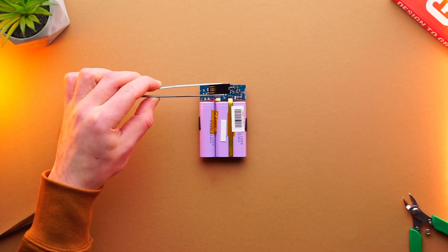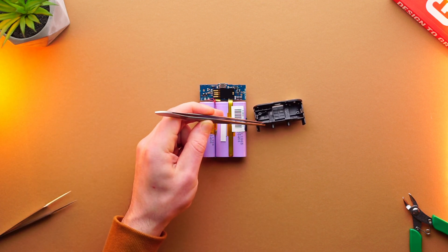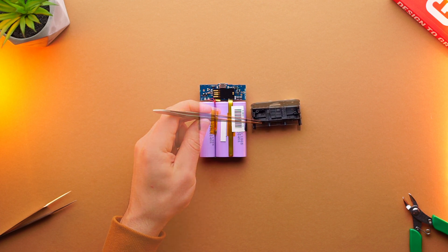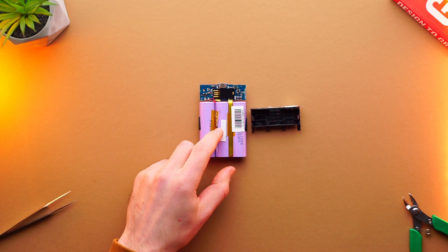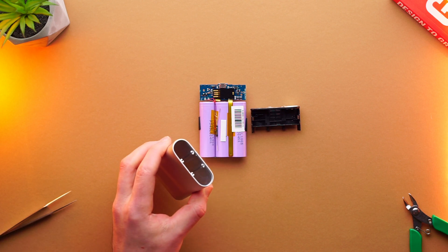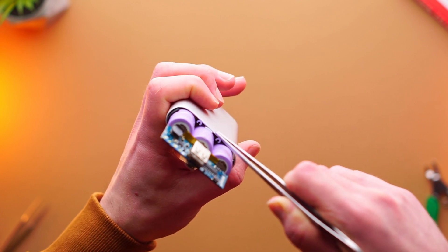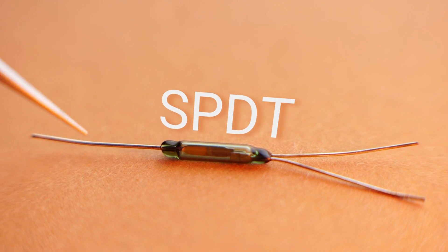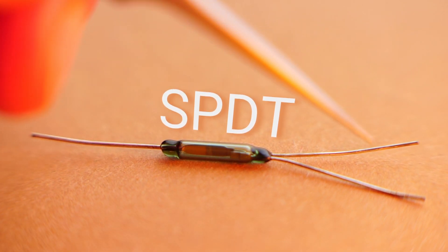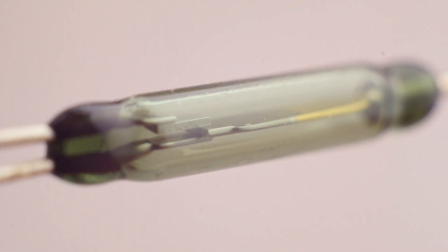There is only one place where the USB flash memory module can be mounted. As you can see, there is no space under the plastic frame, so I will put a switch between the battery cells. This is not the most convenient place because screw channels go through the whole metal body, and there is almost no clearance between the cells and the metal case. This is a magnetic SPDT switch. The SPDT reed switch always stays on, but the direction of power flow changes based on the resilient magnetic element position. When I bring the magnet closer to the switch, it changes the power flow direction.